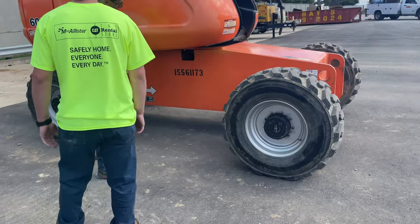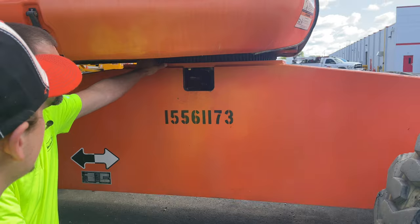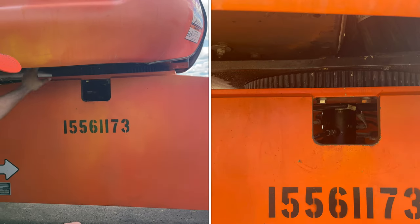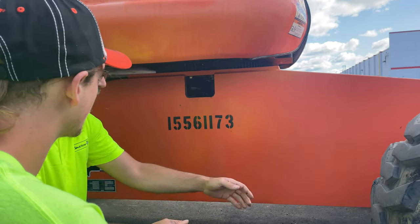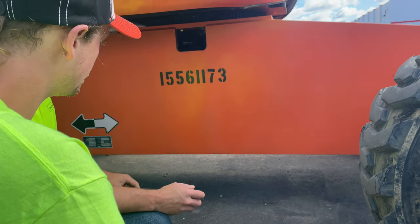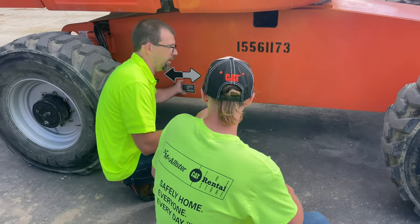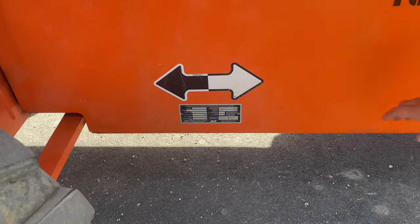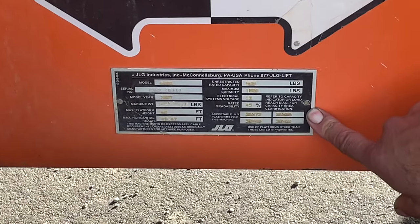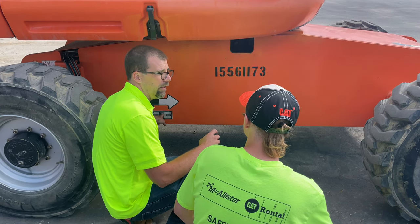I'm not going to open the hood yet. Let's check the swing gear on this side — same thing. I can see this whole side: all those teeth are there and present. Check inside there. Our other clue is whether there are any puddles of oil on the ground — it's looking pretty good. Now on this side, all of our equipment should have some kind of a data plate, kind of like a VIN tag on a car. That must be present. If it's not, we need to get one on there. This tells a lot of things vital to stability — a lot of important information.